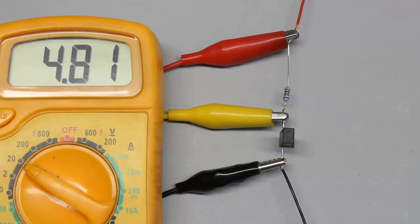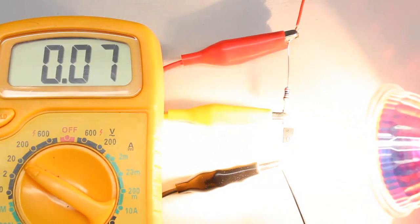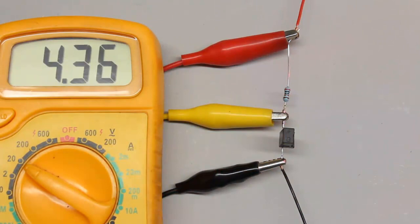Note that the light emitted by the filament of a bulb has a high portion of infrared light. If the phototransistor is exposed to the light of the filament bulb, the voltage drops to 0.2V. Same is for bright sunlight. That's why the photoelectric sensors eventually have to be covered when operating in bright environmental light.